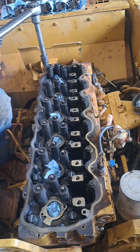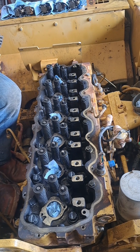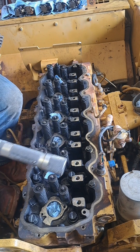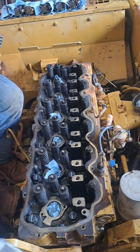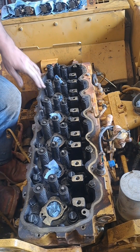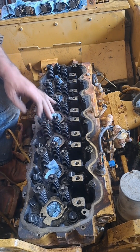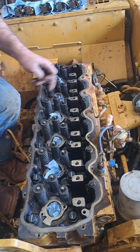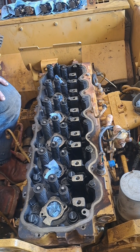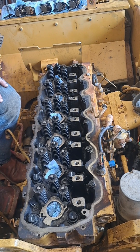Let me catch my breath — too old for that. I've learned from experience: even though I did the torque-turning method here with all these head bolts turned 90 degrees, it busts off somewhere around 375, and that just gives me a guide. On engines with smaller head bolts like the Cummins and the John Deere, you can actually feel that yield torque — you can feel it with the bolt almost without ever having to look at the 90-degree turn. But these fat bolts on the CAT don't really operate like that, so I put the torque wrench at about 375 and it's usually dead on.